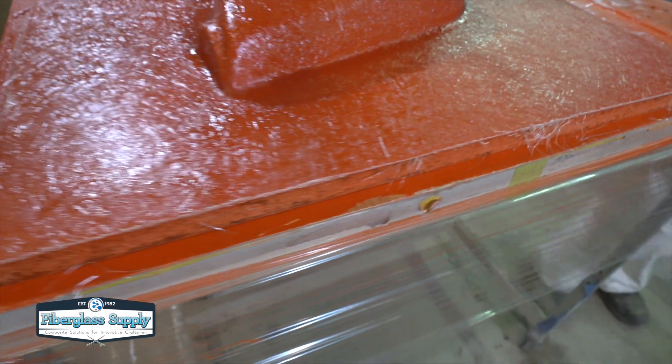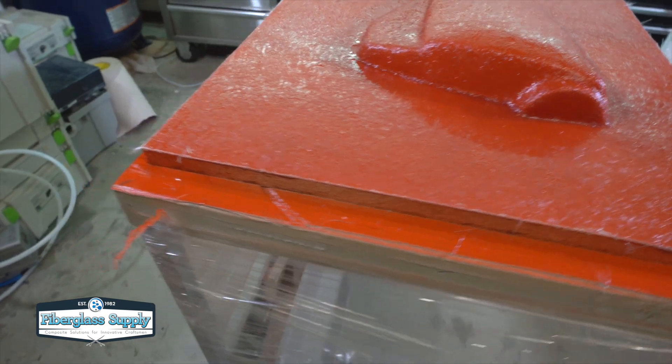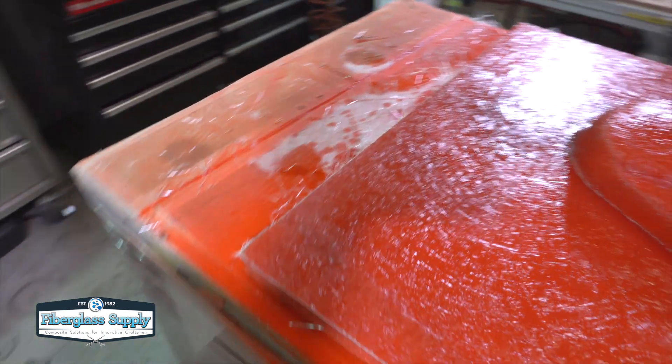This is a great method. It's nice and clean, and when Tim's done here, that mold will actually be about a quarter inch thick, and he'll have done that every time he's done a layup, so it'll take about 30 seconds worth of sanding or grinding to clean up those edges.